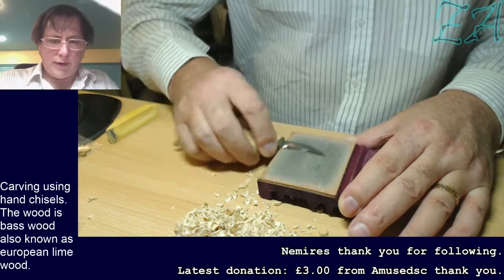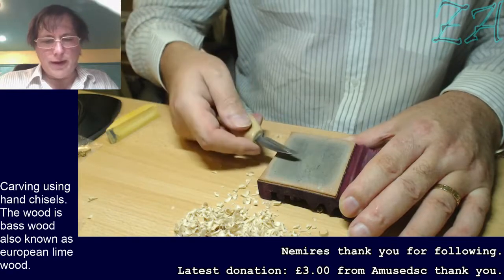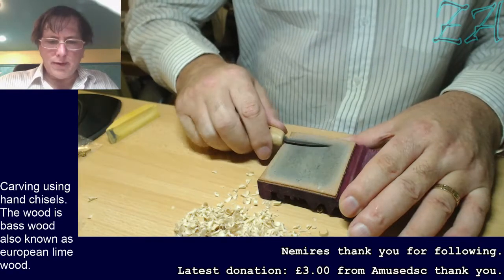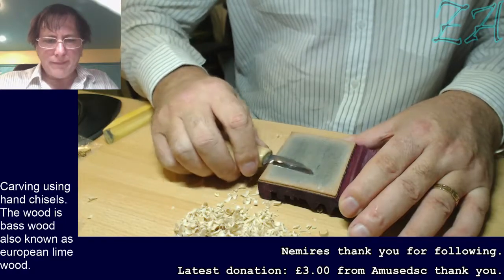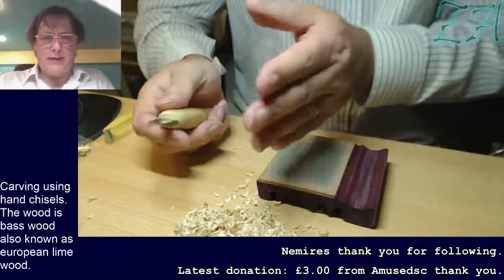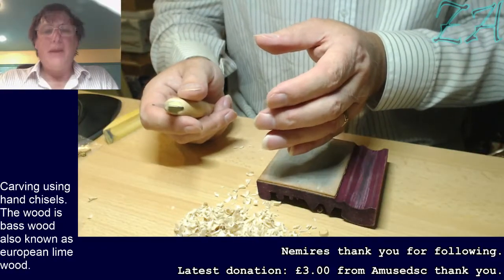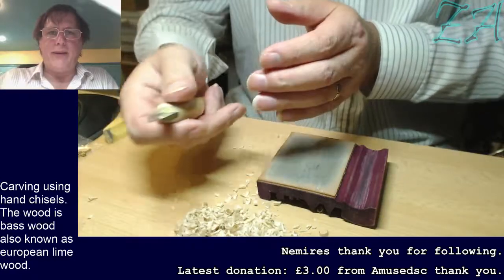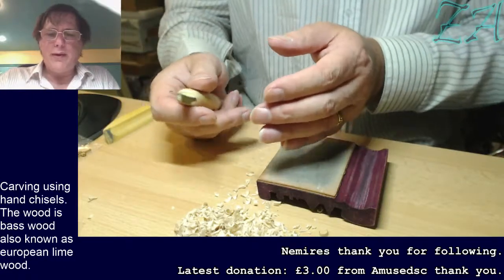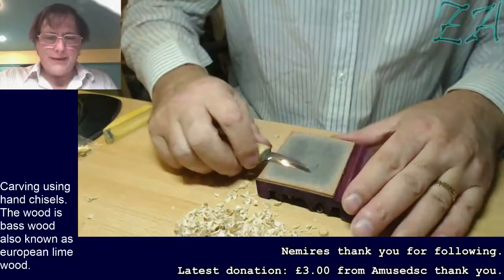A knife cuts because the edge is both really fine and really rough at the same time, but it has to be straight to do that. When you're using these, the edge, which is really really fine, tends to bend over, and when it bends over, you're trying to cut by pushing against here, which isn't fantastically good. So what the stropping does is just straighten it out, and it doesn't need much.